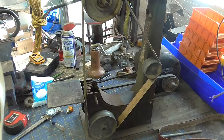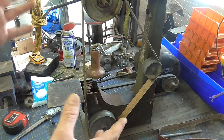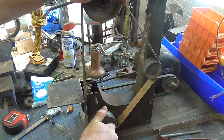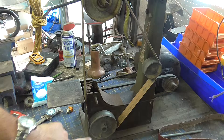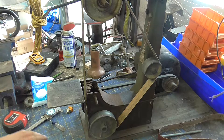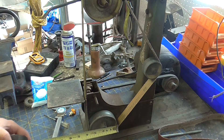But let's say you had a big bandsaw or something that wasn't quite as easy to access with a piece of rope, or you're by yourself and it's really big. Whatever the scenario is, if you wanted to get at least a pretty good idea of what length belt you have, with a calculator or pen and pencil, it'd be pretty easy to calculate by just figuring out the diameter. I've gone ahead and taken a magic marker and marked this wheel here, and measured it to determine that it's three and a half inches.